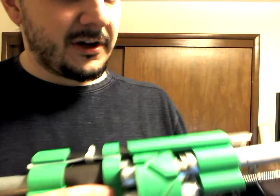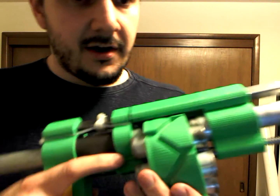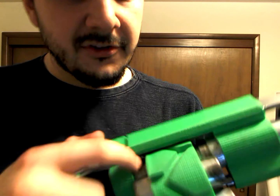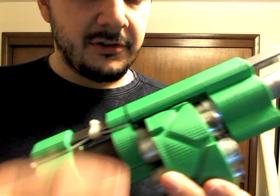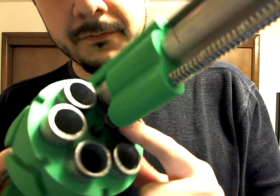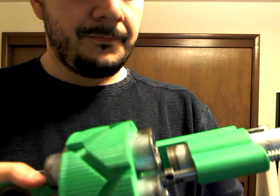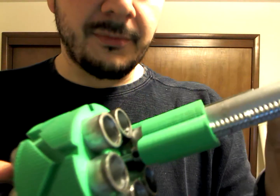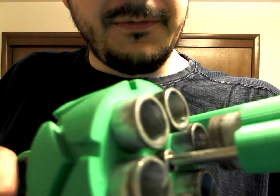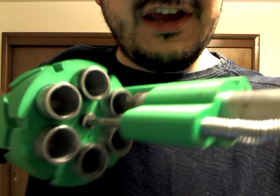The gas seal problem got figured out. That's largely an issue of how long this pipe is — you've got to be able to clear this pipe with the cylinders, the chambers. Then you have a stop up here, which is just a shaft collar in my case, to mark the maximum distance for the cylinder to move forward. So watch: I'm going to pull forward and it's going to hit that shaft collar, which is going to force it to start turning.